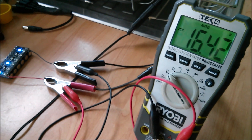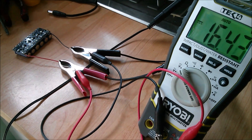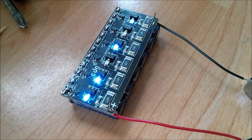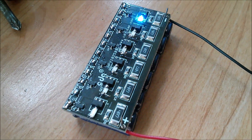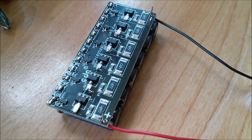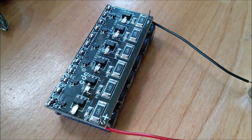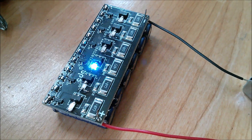Let's take a look at the voltage — it's 16.4 volts. Nominally they should be 2.7 each, so that should be 16.2. They're slightly above that. But I think we worked out that these voltage detector ICs, which will be the little SOT23 3-pin device on the left, are actually designed for measuring under-voltage for microcontroller circuits. So when they're used for measuring over-voltage, they're pushed up to the other end of the hysteresis, so they do actually trigger at a slightly higher voltage.